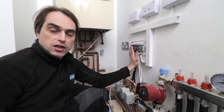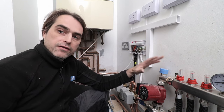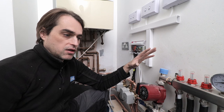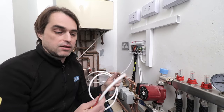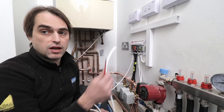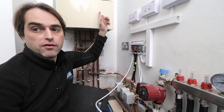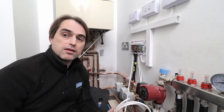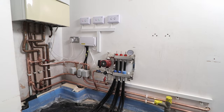You can see I'm not using actuators and not using a dedicated underfloor heating wiring center — but you can only do that if your manifold is serving just one zone, as in this case. The boiler supplies power to the wiring center and the wiring center sends a switched live back on a fourth wire to fire the boiler, though exactly how that's wired varies by boiler type. You can only use this setup if one manifold serves one zone. If you have any questions, comment below and I'll try to answer them.